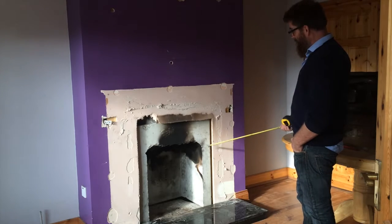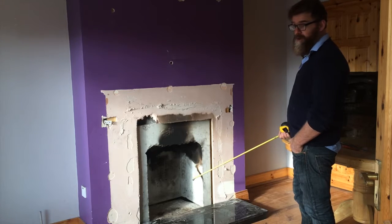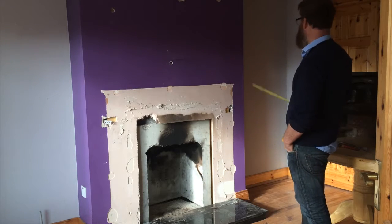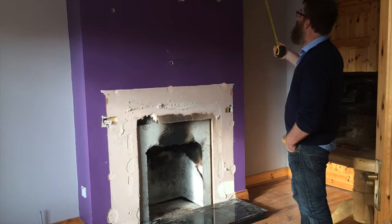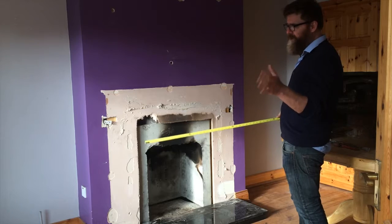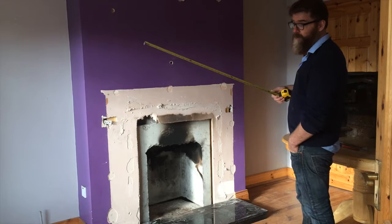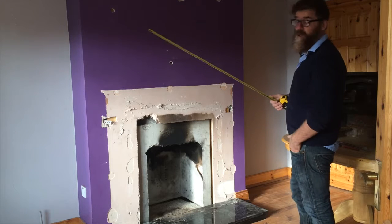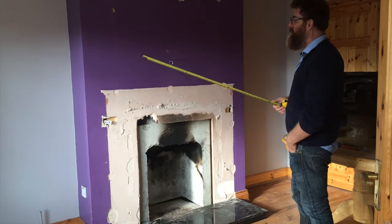But anyway, the bottom line is I'm going to put that back boiler in there, which is going to power all the central heating effectively in this house. And a big concern when you're fitting a system like this is the position of the pump. And one crucial thing, but I will explain that in better detail in later videos, is the position of the pump relative to the vent pipe. That is crucial. Nearly always, but sometimes the design of a house doesn't permit this.